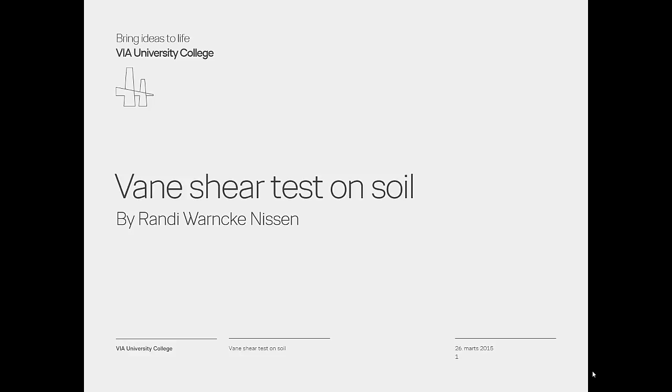The purpose of the vane shear test is to determine the in-situ strength in cohesive soils, normally related to the undrained shear strength of the soil. The vane shear test consists of inserting a vane into the soil and then rotating it by applying a torque. The torque is measured when developing a failure, and this is the in-situ shear strength in undisturbed soil. The torque measured after rotating the vane ten times is the remolded shear strength.